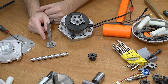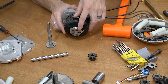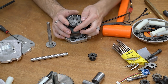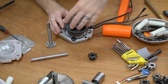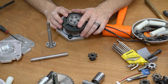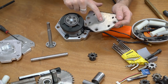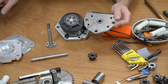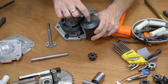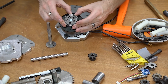Both of these are hardened 4140, so they should be more than strong enough. The other benefit to this design is we have this nice big outside diameter here and we can use a bearing to support the rear of the can — it goes on there very tight. This will actually help support the rear of the can so we won't get as much wobbling. We did something like that on the last design but it was this little tiny bearing, just resting on a tiny little nub coming off the shaft, and it would bounce out of that a lot. This gives a much larger surface area for that bearing to grab on to.